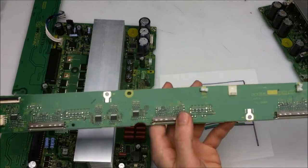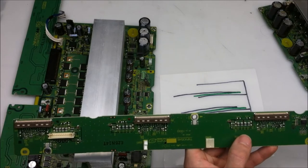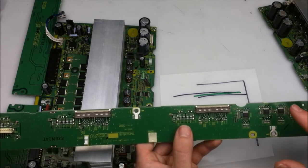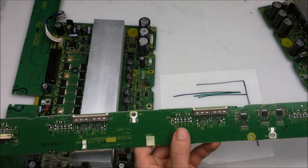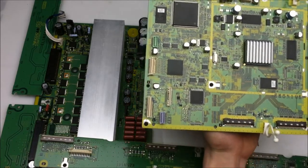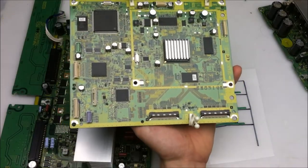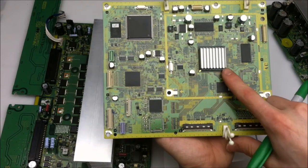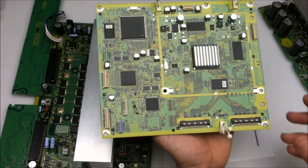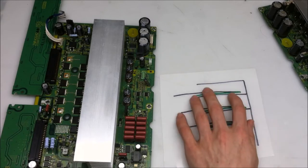And those vertical control wires in the screen are connected to these two lower buffer boards or line driver boards, and each one of them is controlled by a chip as well. These boards are directly connected to the IC on the main display driving board, and we can see here where it links up. So a relatively low voltage signal gets fed from this chip to these two outputs, and each one of these outputs goes to one of the X control wires. And those wires are located underneath here.